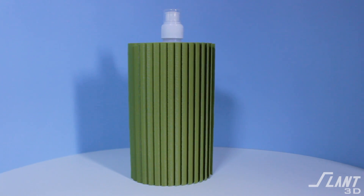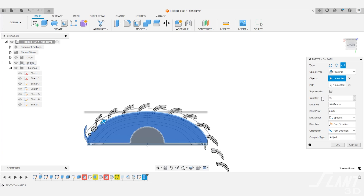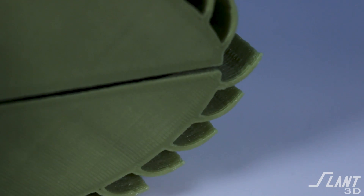With this design, if you wanted something other than the standard white faceted look, you can embellish and create something more unique. This is a finned design with fins around the outer side that can be embellished to create dragon scales, leaves, or some organic shape or pattern — you can make them wavy. This design is almost impossible to manufacture any other way, because all these fins would make it so difficult to release the part from a mold that it's nearly cost prohibitive to even try.